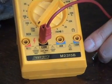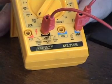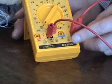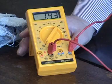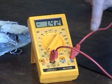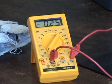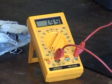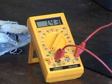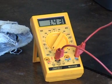If I'm expecting a large current, I should always go with the 10A setting. Because if I put it into the milliamp socket and my current is about 1 amp, it will blow the fuse. So always start with the large amperage, and only go to the milliamp setting if you're sure you've got milliamps. What's nice about the digital meter is that if the current is going the wrong way, it's indicated by a minus sign, but the magnitude is still shown — for example, 1.42 amps. Switching the leads gives 1.43 amps — the slight difference is just because the multimeter fluctuates slightly.